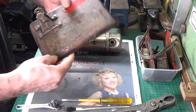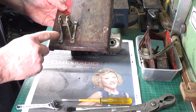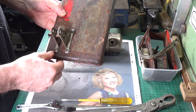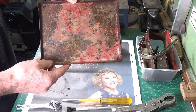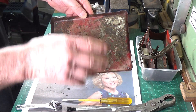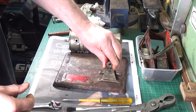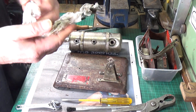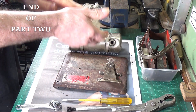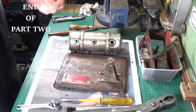Bear in mind we've had all nuts, bolts, and screws so far — the crank mount is actually rivets, so I'll have to drill those out. As you can see it's in a pretty appalling state at the base, but we'll get all that rust off — vinegar will deal with that no problem at all. Any paint that's left we'll use oven cleaner on it to get that off, and then we'll be good to start the repaint.